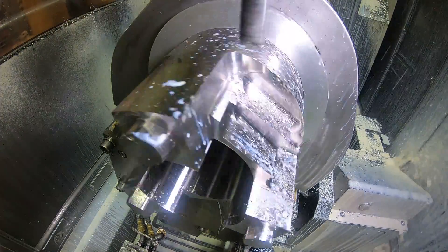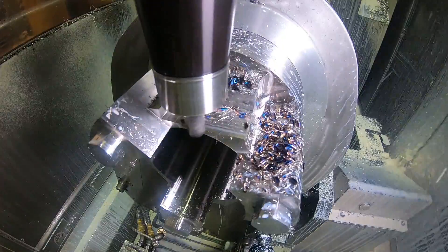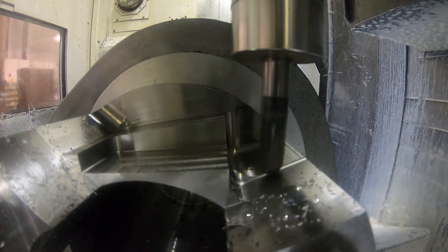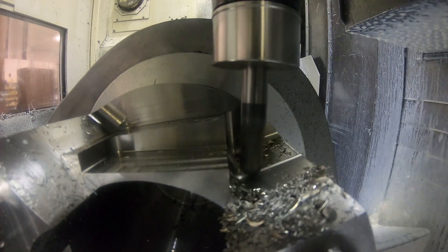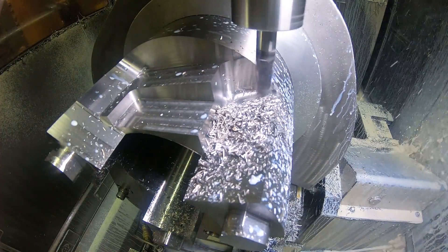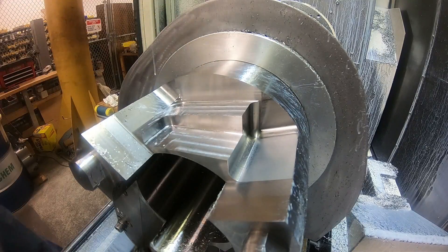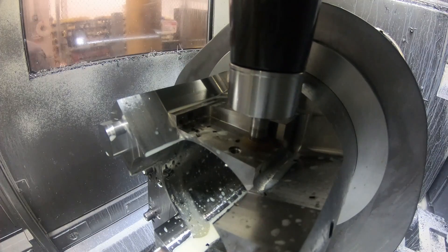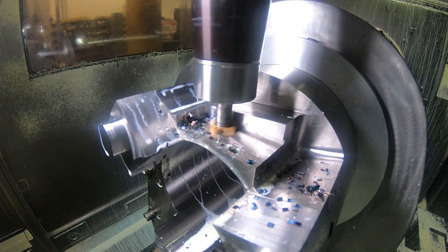Right here that's not critical where it's machining, but this is where it's going to fit that wedge. There's a five-degree angle difference so that it'll make up against the bottom of the part — there's a screw hole put in from the other side later. This is just machining back on this notched area that again isn't critical to the fixture; I just want to make it look a little nicer. Then I come in with a drill and drill and tap this hole where that screw is going to go in before I split the parts. This is a little undercut that's going to help hold those wedges in there so they don't fall out when you take the parts on and off the fixture.